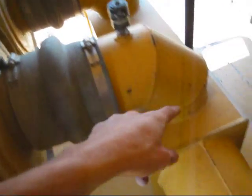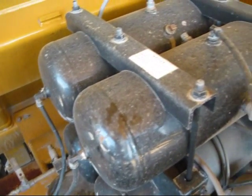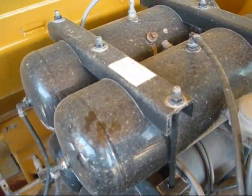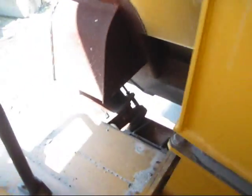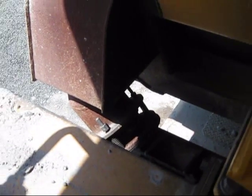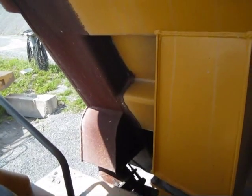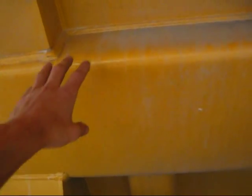The air is then taken, flowed right through this pipe here once it is cleaned, right down into the engine. These four tanks you see right here are for your air pressure — they hold your PSI for your air brakes. The pipe that you see connecting right down there to the dump body takes all your exhaust from the engine and runs it through the body. The purpose of that is to keep the body heated. When one of these trucks is working in the winter, the cold temperatures make the body get really frozen and sticky.